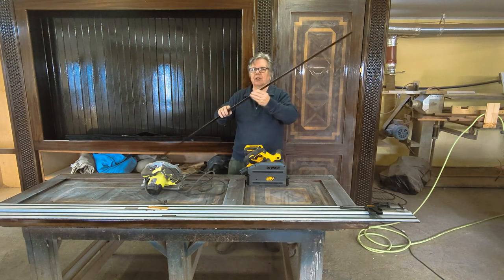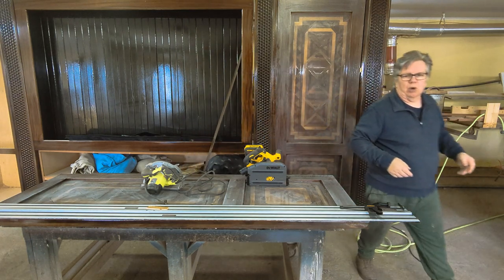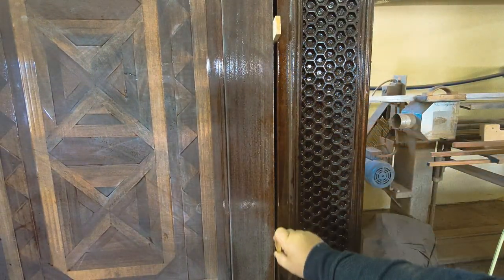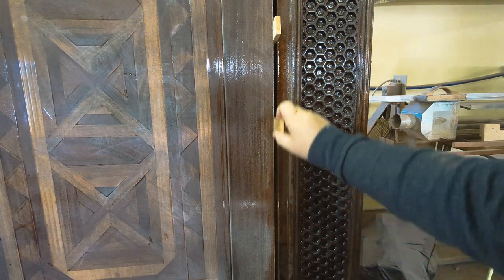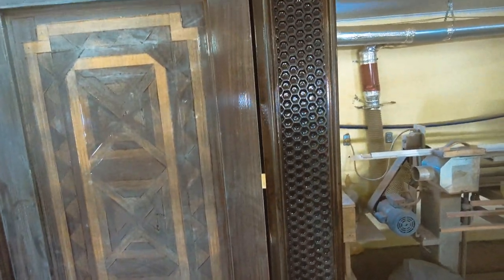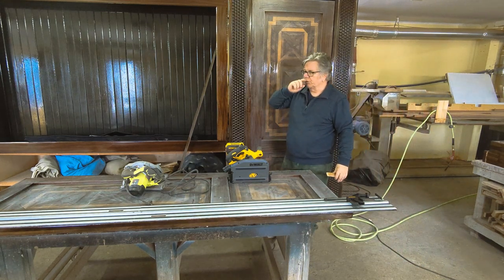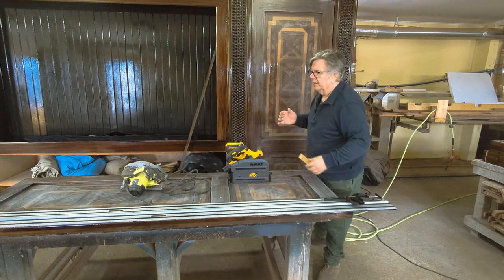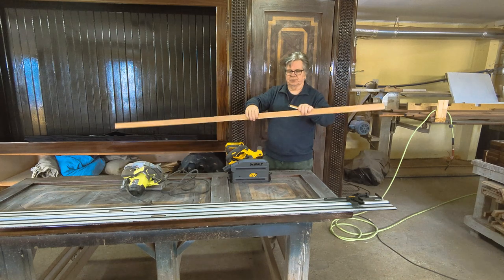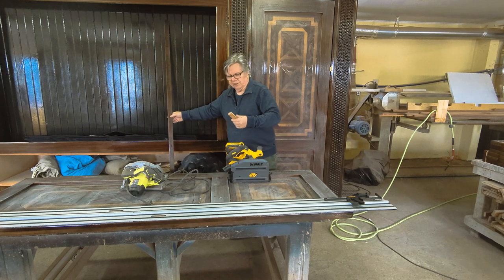This is what I cut off — I had to cut off a quarter inch. I want a healthy quarter inch right across. This is kind of like my spacer here; it's pretty even all the way down. Now I've got to do the other door and I'm doing it on the hinge side. I've got to take less than this — it was about a blade width, about a quarter inch — so I've got to go less than a blade width.